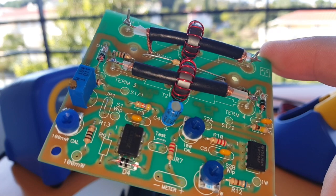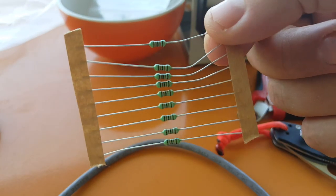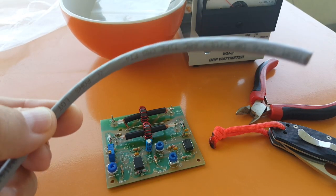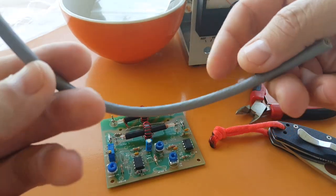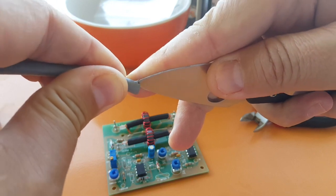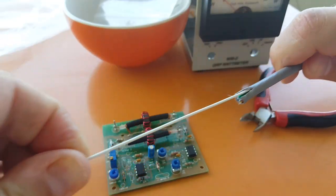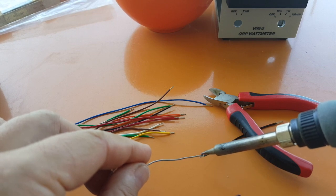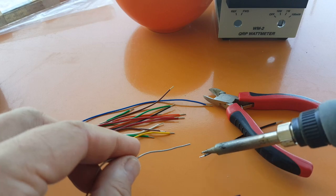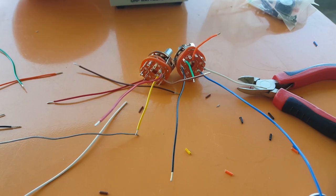Well, except for the missing resistor — hopefully I'll find one. I didn't find the resistor so I had to wait, but you don't have to. Here they are two weeks later. What I like about this kit is that everything is included, even the wire. It's a multi-conductor wire so I have to strip it. The manual even gives you the lengths and colors to cut. You should never cut towards any body part — just pull them out one by one. I cut all the wires to length and tinned the ends. Preparing the wires takes a very long time but it makes things much faster later.